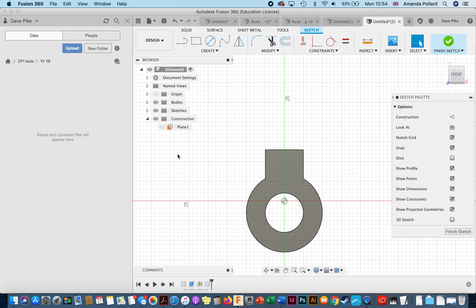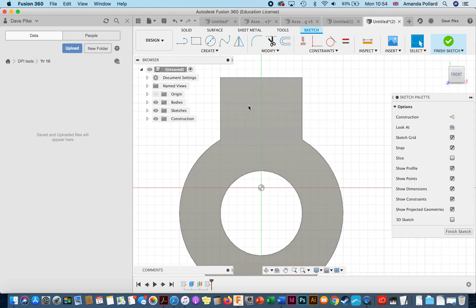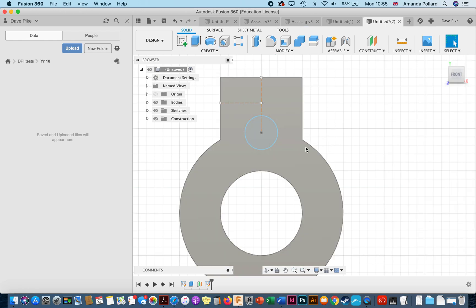Go to sketch and click on that plane. If you need to find your planes, they're listed under 'construction'. One thing to note is that the center point — the zero point — does change. If you're struggling to find an exact point, you can draw construction lines. For example, draw a construction line and type 5 to find the point 5mm in, then come 6.5mm down — that tells you exactly where to put your circle. Create a circle, take off the construction option, set it to 4mm diameter, and finish your sketch.